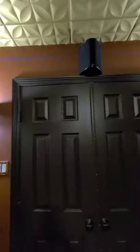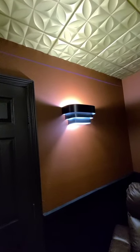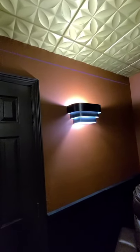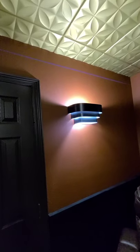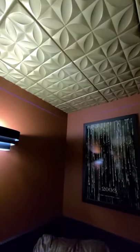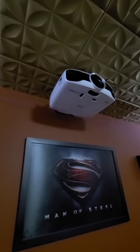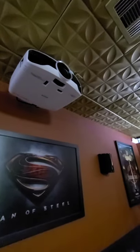When we were figuring out where to position the crown molding, we first needed to make sure we had enough room to get our fingers in to put the lights in place. We also played around with it a bit to see what fit our needs and looked best. We went all the way around with the blue chalk line so we know where the bottom of the crown molding needs to go and don't have to worry about things being uneven.